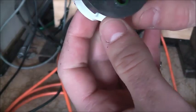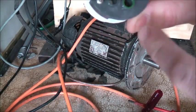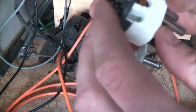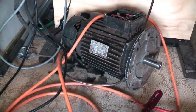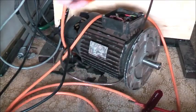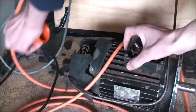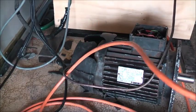Now often these are ceramic. In this case this is glass fibre reinforced plastic. And there's our connections, live 1, live 2, live 3, neutral, not using this one, and earth. C1, C2, not sure, common 1 and common 2 or something. That's odd, never seen that before, but that's a first for me. I'll get this cord untangled. Shattered motor fans in the way. That's what I'll do, you push this all through and I'll wire it up.